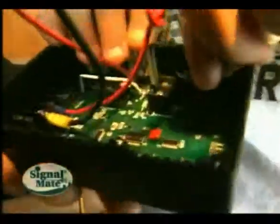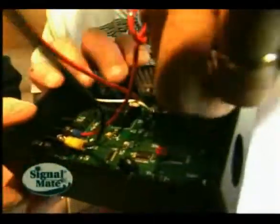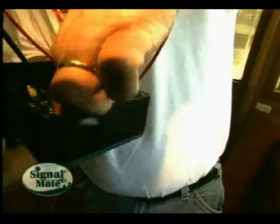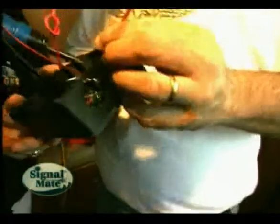If you have several red wires, you can always remember by tying a knot in a wire — the old code: the knot is hot. The output of the Signal Mate is solid state with shutdown protection for currents that exceed 20 amps. Current inrush limits are set at 90 amps to allow for motor start-up circuits and large filament bulbs.